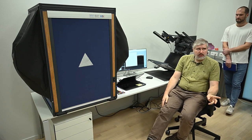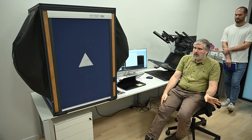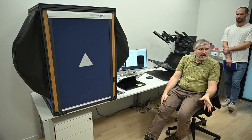Now, interestingly, and I will show this in our thing, what we're going to get is only black and white images because sensors in cameras are only sensitive to photons hitting them, right? So all they know is whether there is light or not. We create color by something called the Bayer pattern, which I'll show in a slide, but we've removed the Bayer pattern off of this because we're not shooting in red, green, and blue. We're shooting in a bunch of different things, and we're controlling everything.